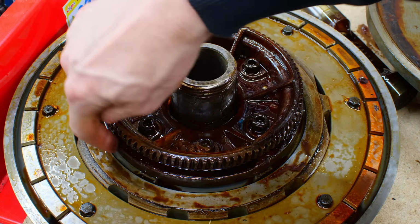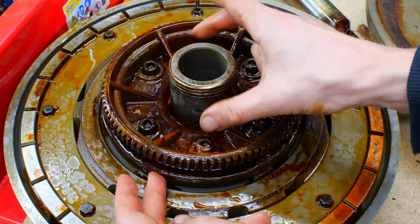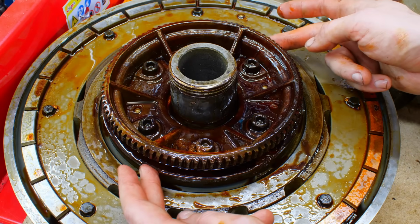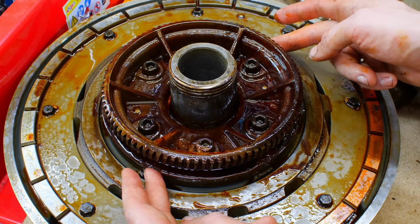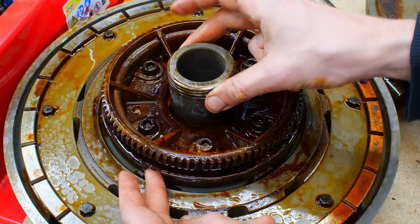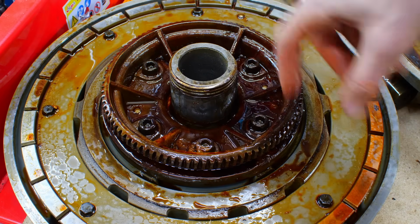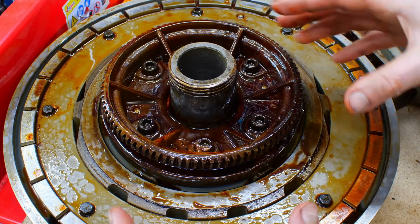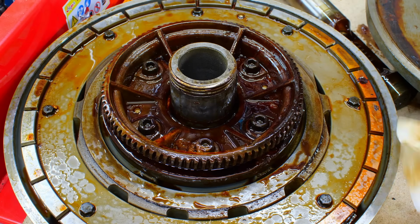The guiding surface for the diameter is out here. That's way larger, which is also beneficial compared to the small diameter here. This large diameter matches a large bore in the base casting, and this is guiding. And this here is just for clamping. With the large thread back here and the large nut with the lever on it, it pulls the rotary table's platter or the faceplate up against the casting and locks it in place.